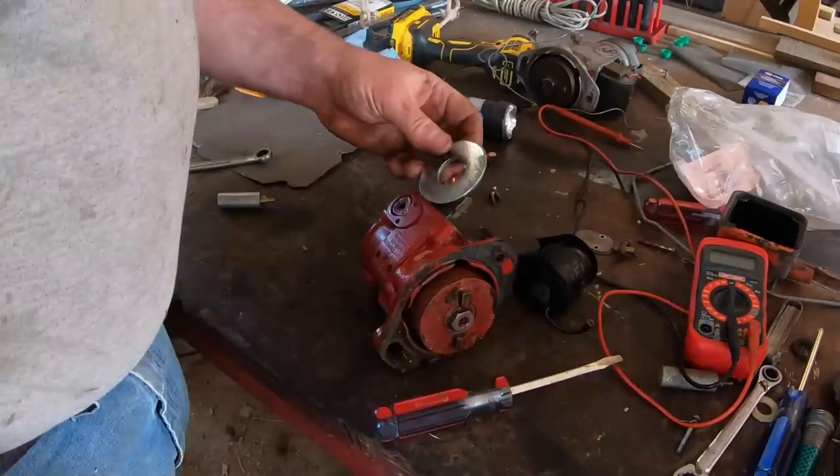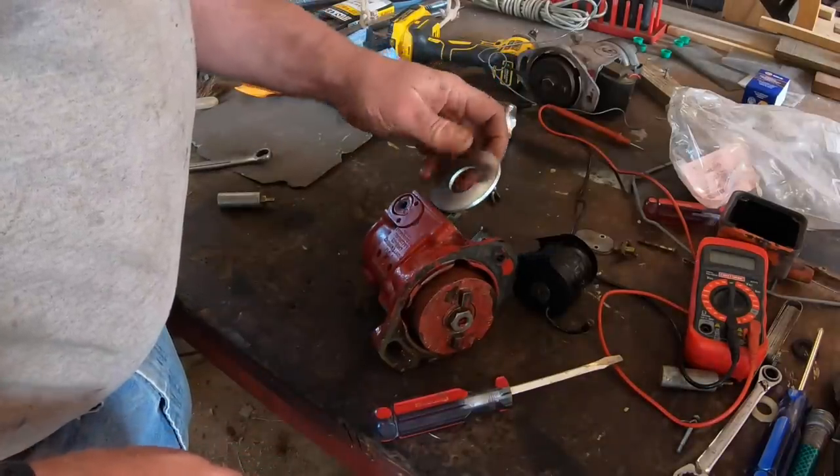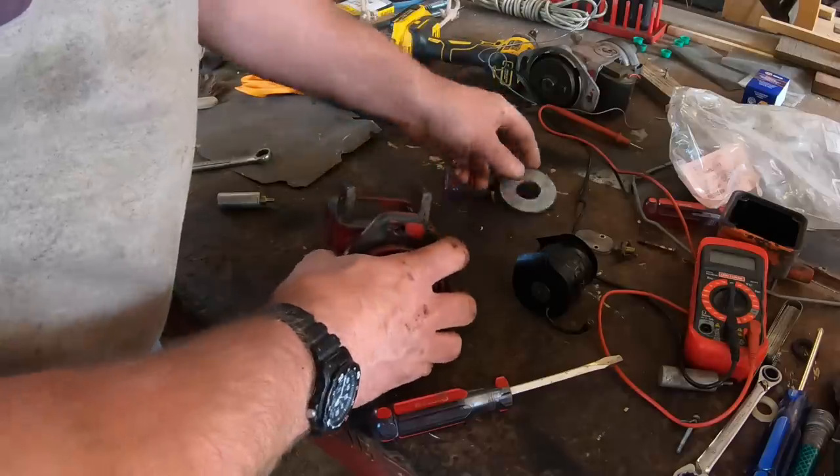I test to make sure the magneto horseshoe magnet is still magnetized, using a washer to see if it attracts it, and it's still magnetized — it's fine. The magneto's armature, or the spinning part of the magneto, rotating through that horseshoe magnet's magnetic field is what gives the magneto its power. It's what moves electrons along, and that's the only real difference between what International called a battery ignition unit — or what we call a distributor in cars — and a magneto. The magneto has an armature to generate electricity spinning through that magnetic field, while a regular distributor or battery ignition unit just gets that electricity from the tractor's battery. Otherwise, all the parts of the two systems are really the same.